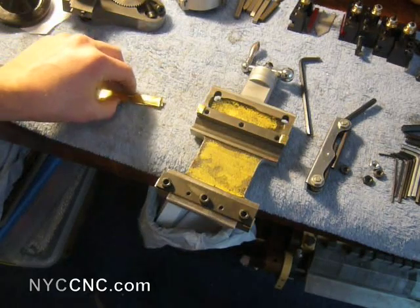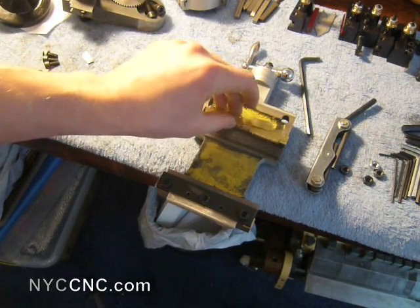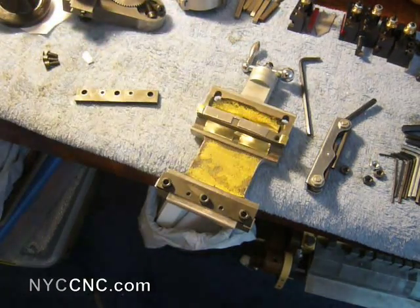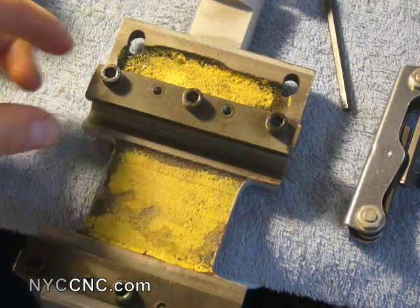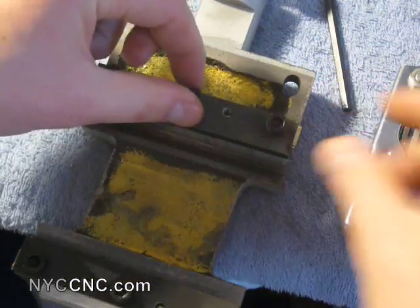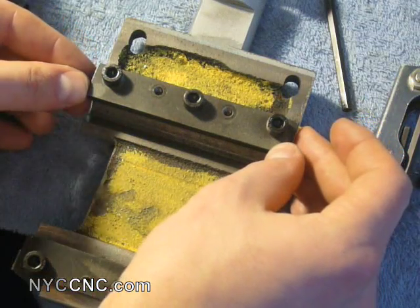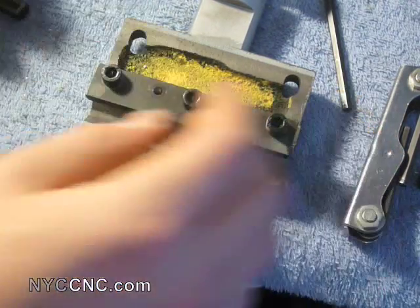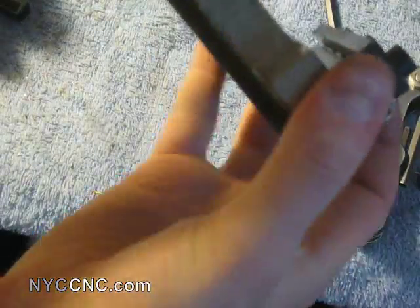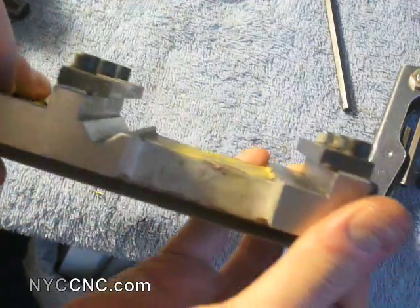What I want to do quickly is show you — I'm going to set these gibs on here. It's a little tricky; I need to use two hands. I laid the gib over top of my shims, put the center screw in, just snugged it down, snugged down the sides too. Now that it's snug I can adjust the shims a little if needed. The most important thing is that they are not protruding in the path of the v-groove there — and you can see they shouldn't be. Same with my other one.